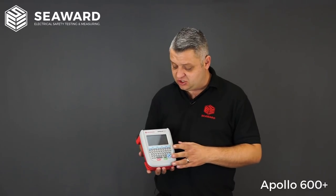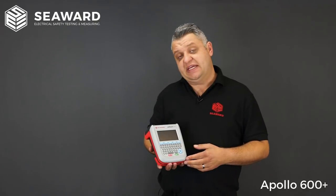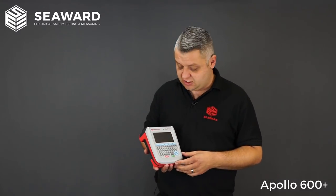In addition to the PAT features on the 600, above and beyond the 400 and 500, we've added the universal risk assessment form and emergency lighting and fire alarm certification — moving away slightly from just being a portable appliance tester. The 600 can be used with associated accessories such as label printing and barcoding systems. When used with the Test and Tag Elite 2 printer, you have the facility to read both 1D and 2D QR barcodes, making retesting much more efficient and faster.